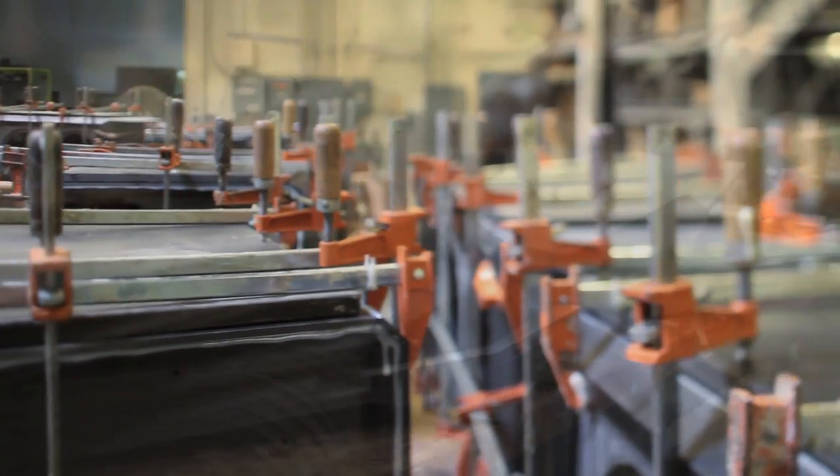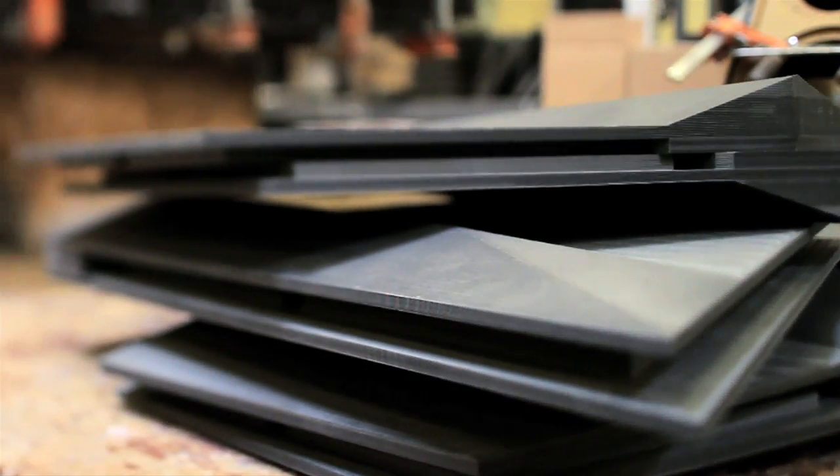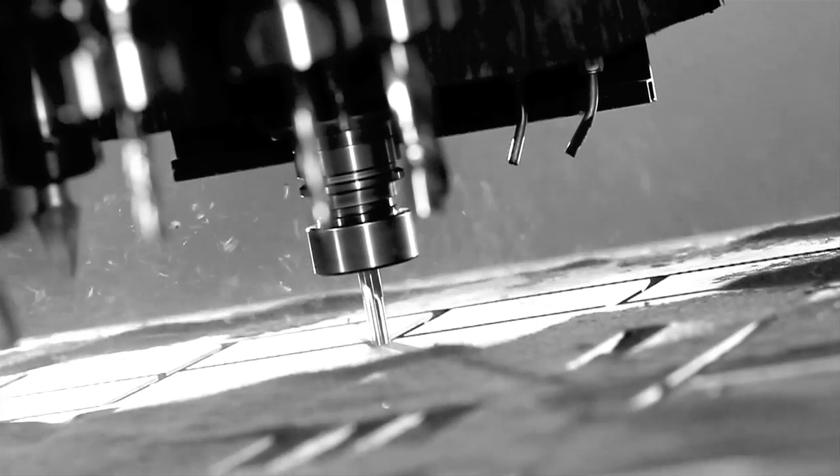We could build speakers out of a quality grade of MDF that would look just like the ones that we build out of X material. And our full manufacturing cost would be dramatically less. The material has to have hardness. I mean, it has to be hardness almost to the point of steel. If you use a softer material on which to mount your drivers, you will compress the dynamics. If you go to a material that has very little intrinsic internal damping, then you end up with ringing. The material, like X material, it's very hard, and yet it damps almost outrageously well.